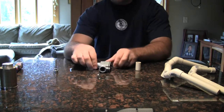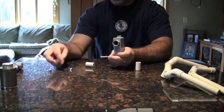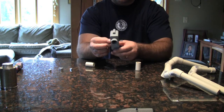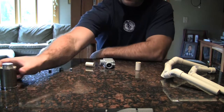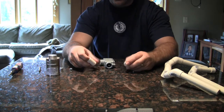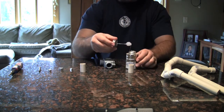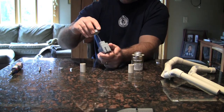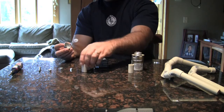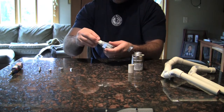So once I had to drill a hole in this conduit box. The gray is conduit and the beige piping is actually plumbing piping. I drilled a quarter inch hole and I have a quarter inch, two inch long bolt that can go up through really nice and smoothly. Before I put that in I'm going to want to attach the next two nipples, the inch and a half nipples to this conduit. I had to grind a little bit with my Dremel tool inside that gray conduit box because the PVC plumbing pipe doesn't fit as well — it goes in but it's a little too tight, so I just sanded down the inside with my Dremel. I'm taking PVC cement and applying it to the inside of the conduit box and to the outside of the PVC nipple.